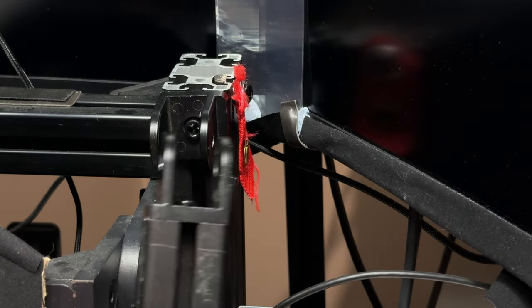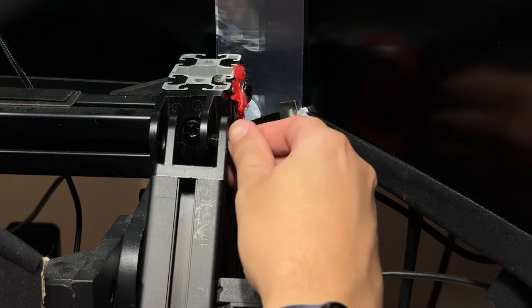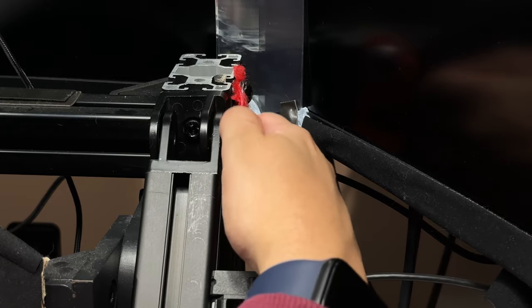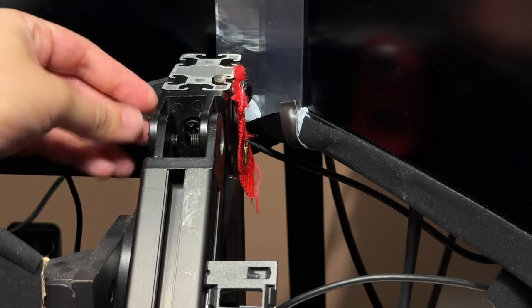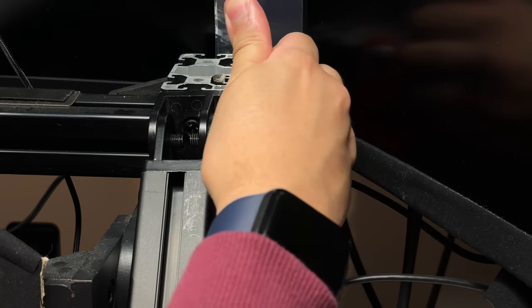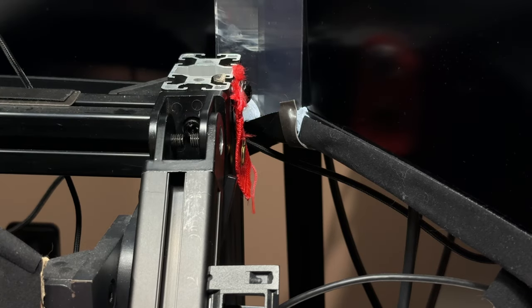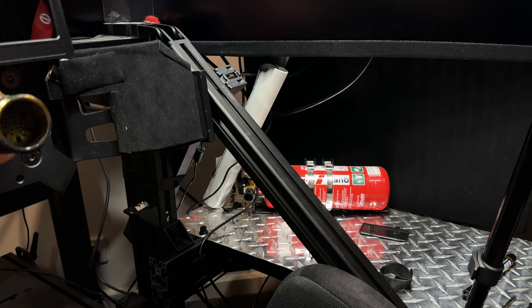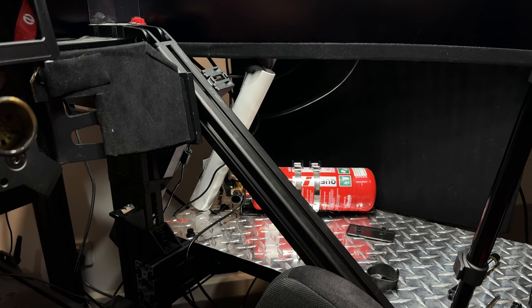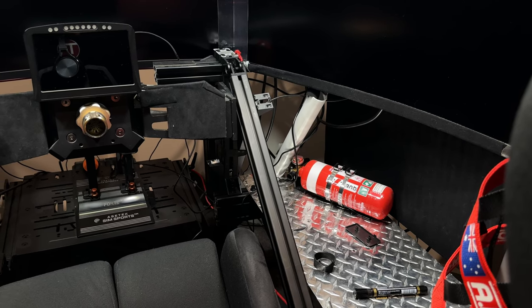Now take the aluminium profile and connect the swivel mounts together using the included screws. Make sure each part of the profile side is to the right of the rig mounted side. Now we can tighten everything up. These swivel mounts are designed to still be movable even though they're tightened, so you'll still be able to make changes to its position later by applying a little bit of pressure on it.